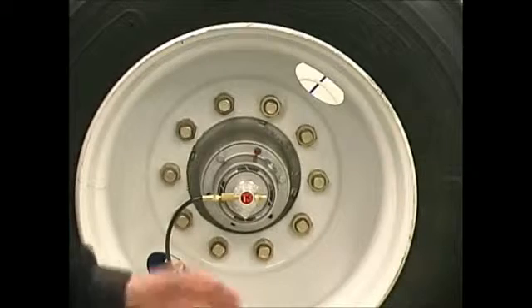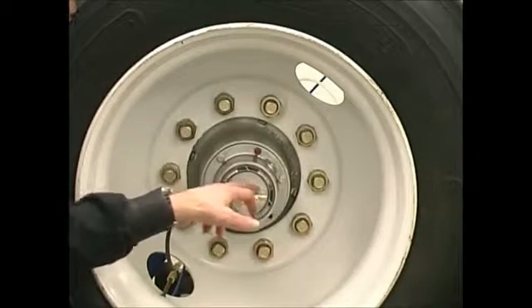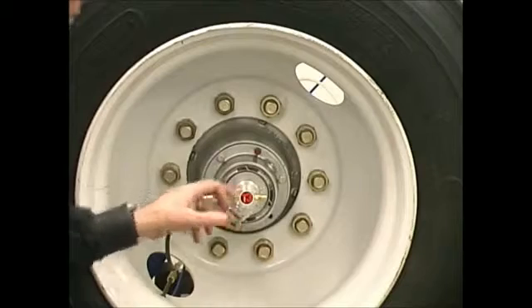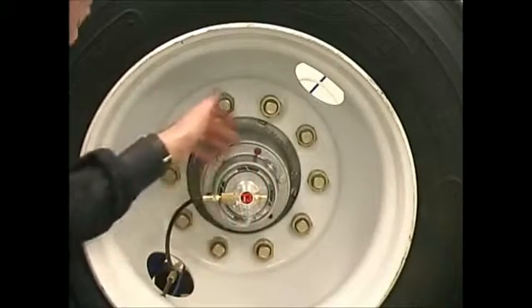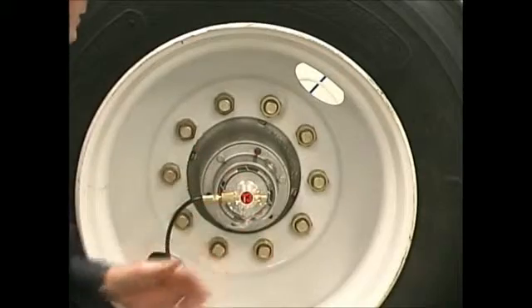As you can see here, we have a leak. These bubbles are actually coming through a series of poppets that are mounted onto the T3 hub. These poppets are spring-loaded valves with an O-ring seat that allows any type of pressurized air inside of the hub area to vent into atmosphere.